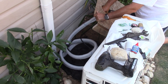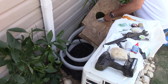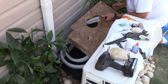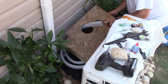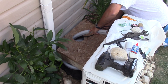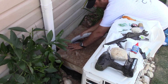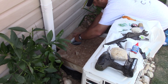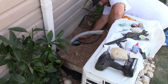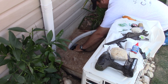I notice a lot of people just coil it up vertically and it looks pretty hideous behind the unit. By laying it flat like this — the manufacturer called it serpentining — it should prevent oil from getting caught. Also, I'm not putting earth or soil right against the lines, so we're using air to actually insulate them. I have this box sitting on top of the landscape fabric and here I am pulling the lines through it and maneuvering everything into place. Once set, it should be hidden but accessible if needed.